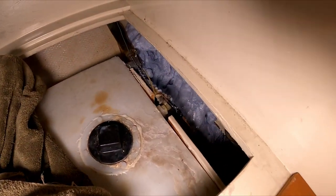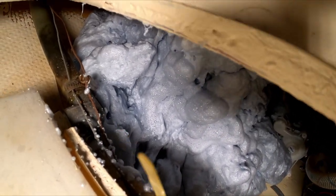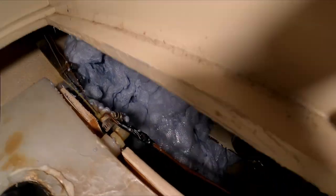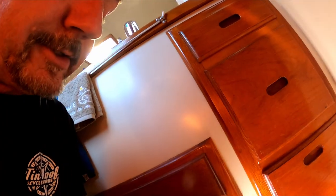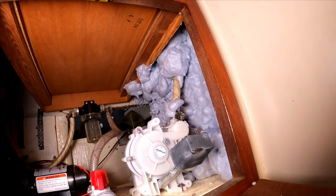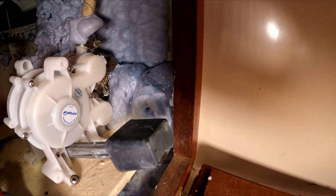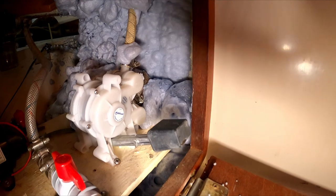You can see all the foam down in here - I've gotten underneath the refrigerator, you actually just can't see the refrigerator anymore. The foam is all the way back up in there. It's not pretty, but it's foam. Let's take a look in here and see how this turned out. I had to spray the foam way up underneath inside where this cabinet is, and it filled in the gaps. You can see it's filled in underneath the refrigerator and back up to this pump, which I can carve some out from if needed.